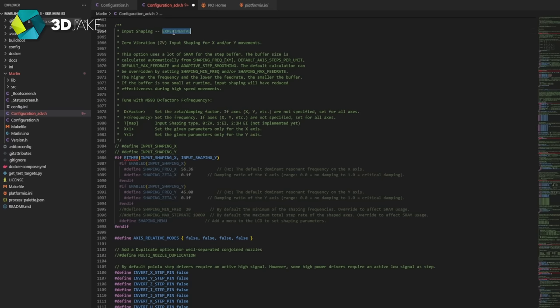but I don't think this is going to be quite as impressive as Klipper's input shaper. So there are five variables here for input shaping. D, which is the damping factor — essentially how strong the compensation is. F is the frequency, which is the input-shaping-defined counter frequency for resonance control.